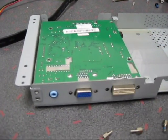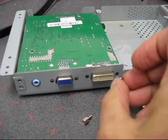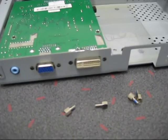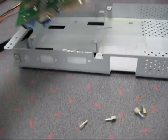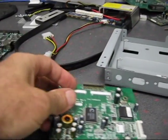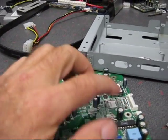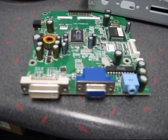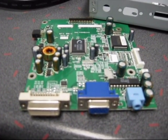In order to take this board out we have to remove these four captive lock screws using needle-nose pliers going counterclockwise to loosen them, and then the board comes right out. If you look at these capacitors, they're all nice and flat — the tops are flat — so the problem is indeed on the other board, the main power supply board, as I suspected. We're going to put this board back in and replace the four capacitors on the other board.